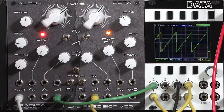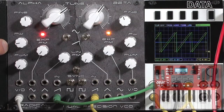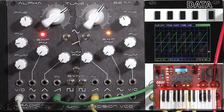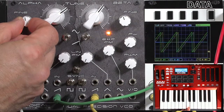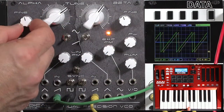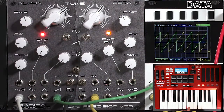Right now I have sync turned off, and I just have two detuned VCOs. As I mentioned earlier, this dual VCO, like several others, exhibits what's called entrainment — if you get the two oscillators fairly close to each other, they'll lock in or sync all on their own. Let's go ahead and fine-tune alpha here. Once it got close, they've locked in together. A little bit of drift there until they cross, and then they lock in.